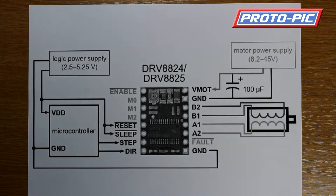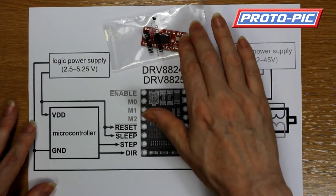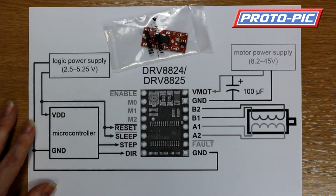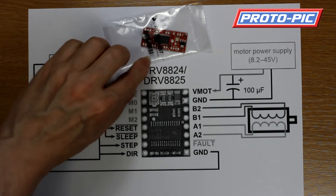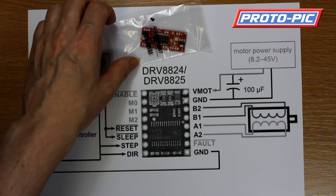To put it into perspective, the easy driver is capable of full-stepping — so if you have a 200-step motor, that will do 200 steps to give you one revolution. It also supports half-stepping (400 steps), quarter-stepping, and one-eighth stepping. You select those using the MS-1 (micro-step 1) and MS-2 (micro-step 2) connections on the board.